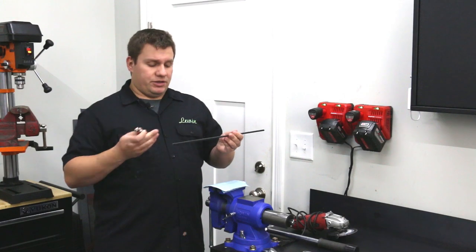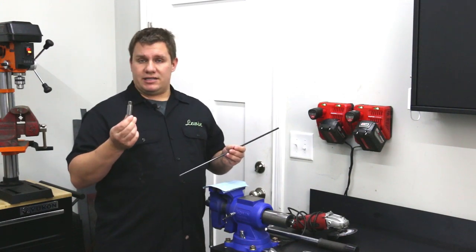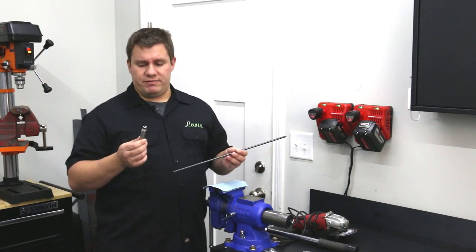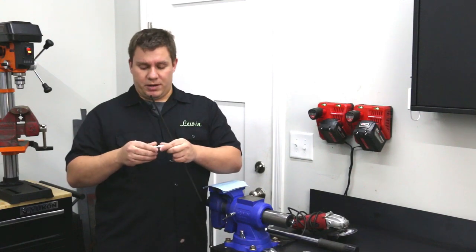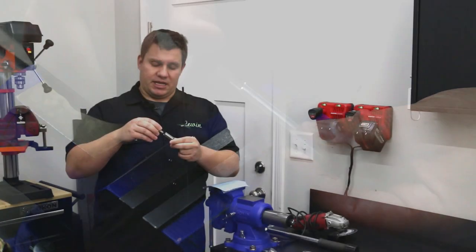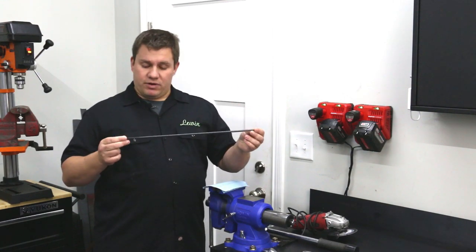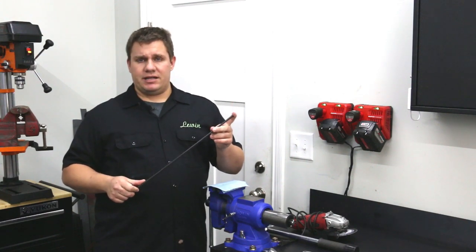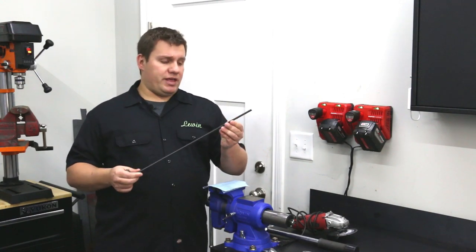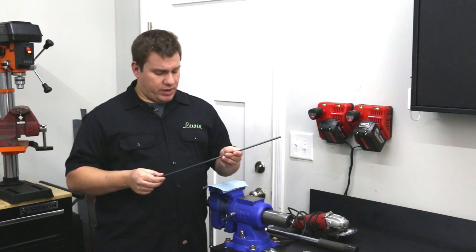The other end is how to actually use them. We needed to come up with a way to connect to a carbon rod or structural fiberglass rod like this, so we made our own collet system — this is really the only way we could think of. This is completely custom, something we designed, made out of stainless steel. It comes with two parts: the nut side of the collet, and the actual taper end inside that tightens it all up. These rods are made specifically for us to match the ID of the nut and make the system work extremely well.